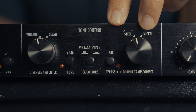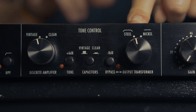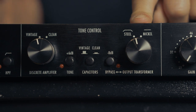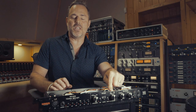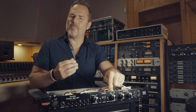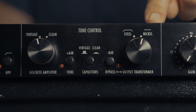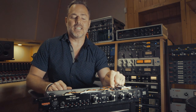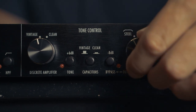Next, I want to talk about these two switches — our selector between two different output transformers, both manufactured by Cinemag USA, so they're extreme top end. This is where I hear the most difference in this unit. The steel core is going to be the most vintage, maybe the most colored — it's kind of a mid-forward thing, and you will really hear it if you're overdriving into distortion. Next, if we turn that knob we hit our 50% nickel core transformer, which was custom made by Cinemag just for this unit — it's the only one like this. It's an extremely sweet sounding, heavy weighted analog sound. As you drive the input level up, you will hear the difference between these two settings.